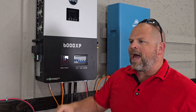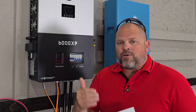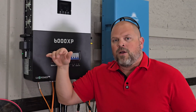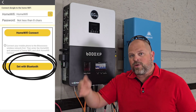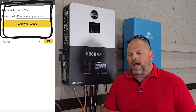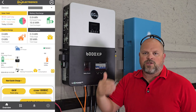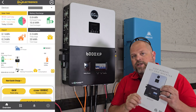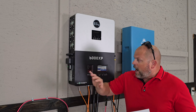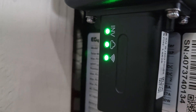Online I could not get it to connect, but through the app you log out and then you'll see a section that says 'Connect Dongle' — that's how you connect it. I was trying to connect while logged in and couldn't find it anywhere. Once I logged out, I tried connecting through Wi-Fi first but that didn't work, so I connected through Bluetooth first, got it to appear on my screen, then went back and reconnected to Wi-Fi, and everything works fine. If you're having trouble, follow those steps or reach out to EG4 or your supplier and they'll walk you through it.